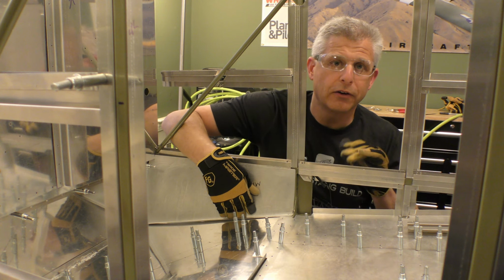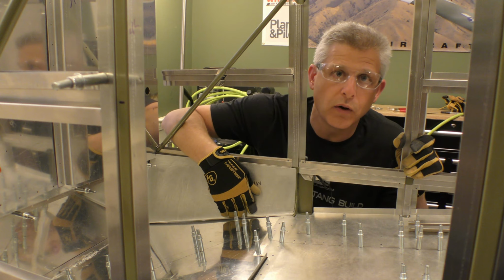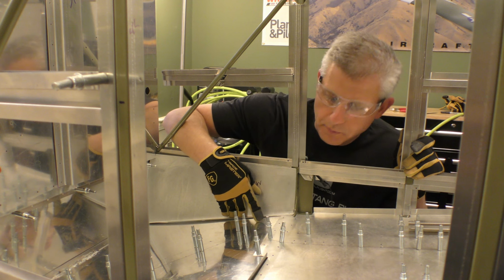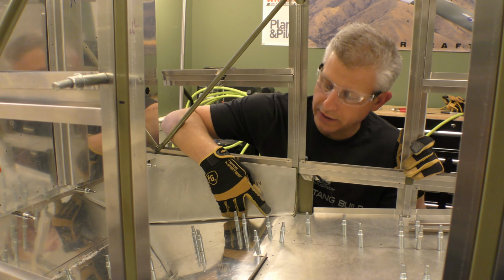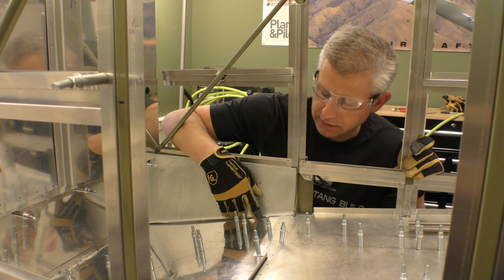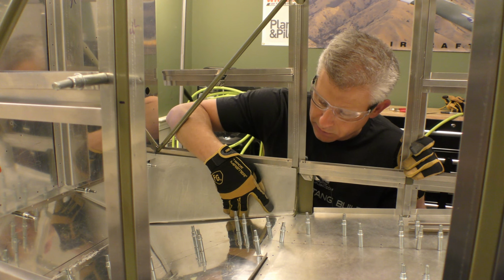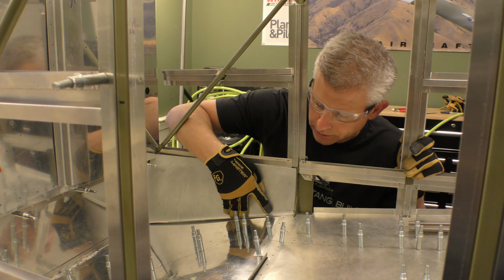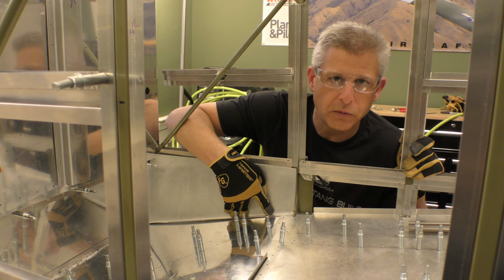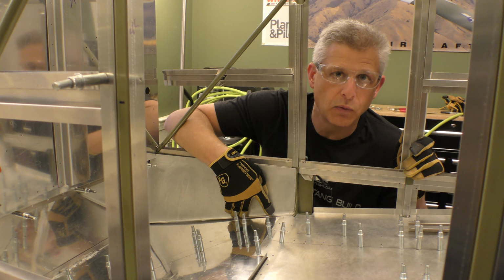As different parts of the aircraft get assembled, inevitably we have sections where different things get layered upon one another, and that makes it really hard to plan in advance when you're drilling holes. We did our best when we were doing the forward cockpit floor at putting in the rivet pattern that made sense for the doubler underneath it to provide good structural integrity. But once we put in this little kick panel here, we see that we're partially overlapping a hole. In this particular case, it's probably about 25% of the hole that's being overlapped by this little flange.